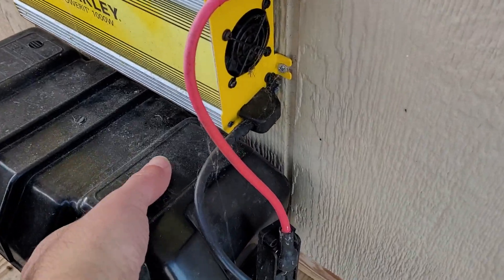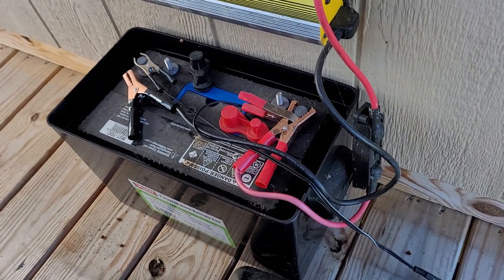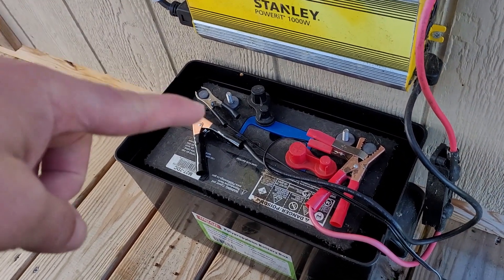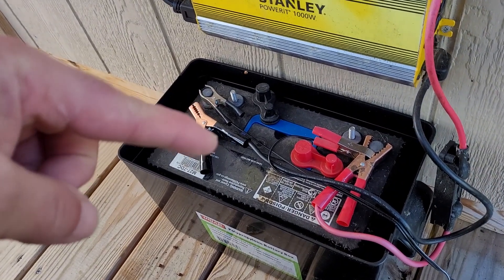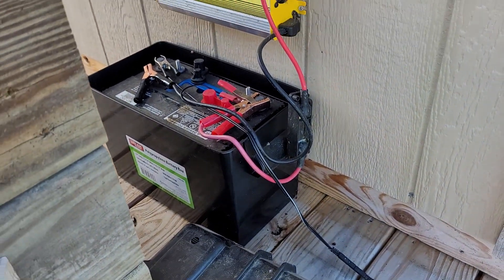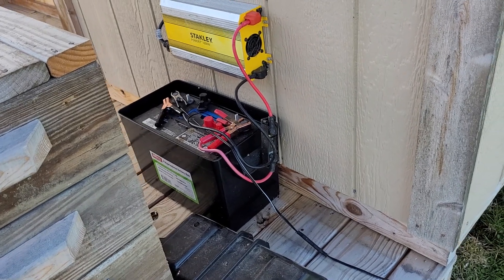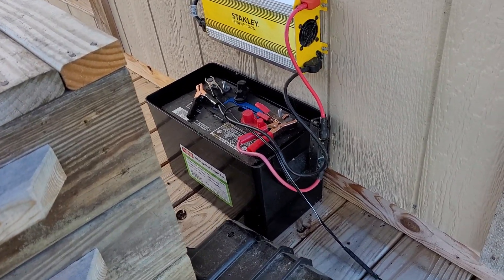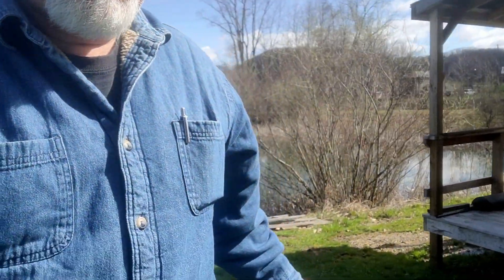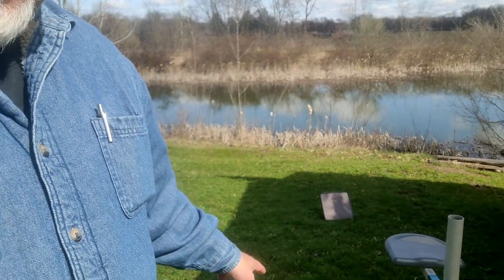Now what I've had to do — take the cover off here — I've got my battery in there, it's a deep cycle marine battery. I've got little alligator clamps on there for the solar panel, and then the bigger ones go to the inverter. I'm going to make a few changes: I've got a switch I'm going to mount on there, and I've got another solar panel — a bigger one, a 50-watt panel — that I'm going to mount with a built-in charge controller.